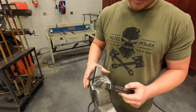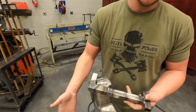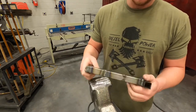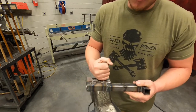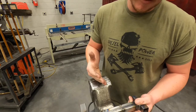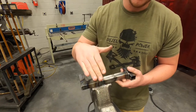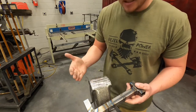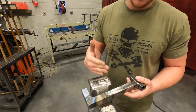When you guys are grinding these, you're going to be using the vise. Depending on how big your part or project is, you could clamp it to the table or use our magnet board table, but these are really small. I don't want you to try to hold them when you're grinding — get them put in the vise. Please, when you clamp into these vises, I know they're old but they're expensive. Clamp your tube so there's enough surface area above the jaws that you're not going to be constantly grinding into the vise jaws.